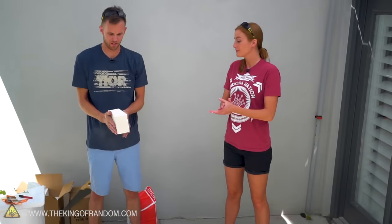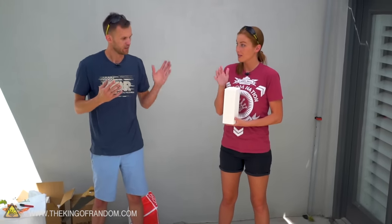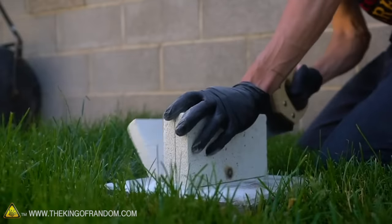As one of the primary sources of insulation we are going to be using fire bricks again. If you're trying to find these, I recommend searching for insulated fire brick. As bricks go they're fairly lightweight, and the lack of density is actually a lot of what gives it its insulation — air doesn't travel through it well and it doesn't conduct heat right through the solid parts of the material. The problem is it's a little too thick; we wouldn't really be able to fit any of those in there and still have space for anything. So we get to do a lot of cutting — we're gonna cut these bricks into thirds.